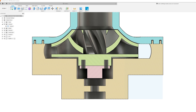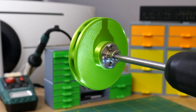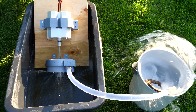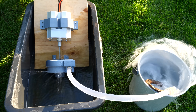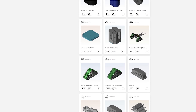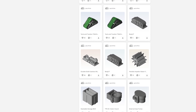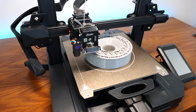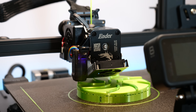The difference between this water pump and my other 3D printed water pumps is the impeller. 99% of DIY water pumps have a semi-closed impeller, but this one has a closed impeller. Also the water pump housing has a volute discharge channel — the gap between the impeller and housing expands — and the measurements for the housing, impeller placement, twist angles, and so on were actually calculated.